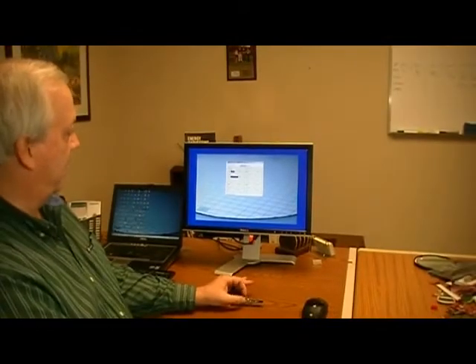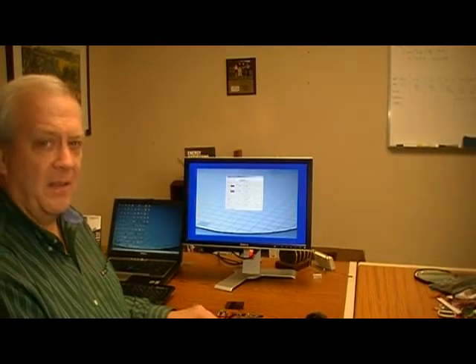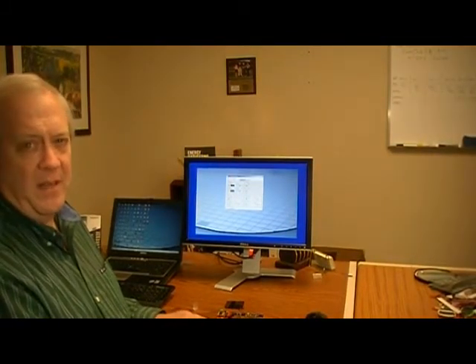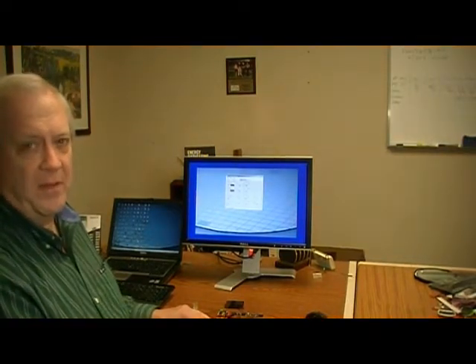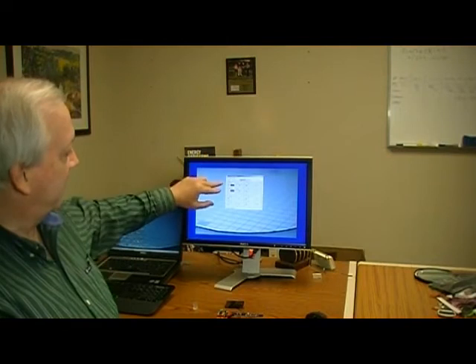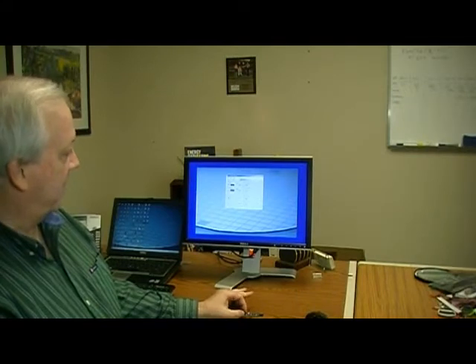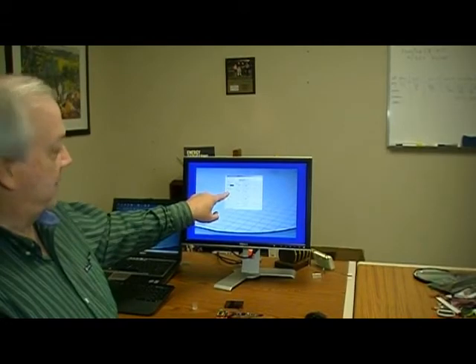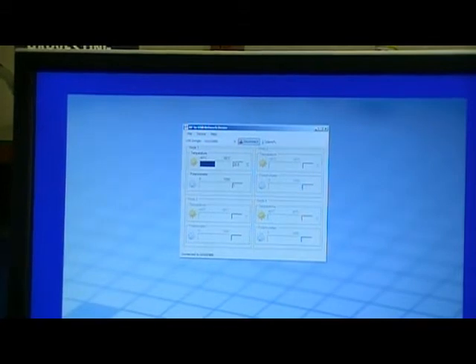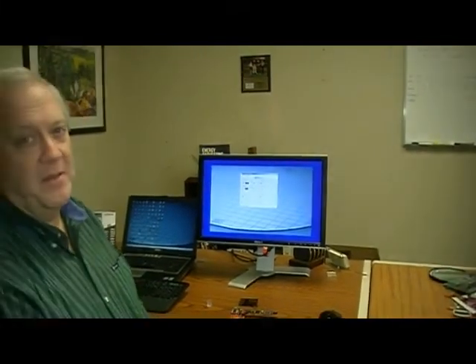Currently this is programmed to update every 10 seconds. With low energy harvesting, typical RF links have a low bandwidth, so we've set it up to be 10 seconds. You can see now that the potentiometer has come down to about half of the value it was at. I'll set it back farther down — we'll wait a few more seconds until we see the light blink to say the potentiometer goes back down to zero. That's basically how the demo runs. You can imagine any payload could be sent rather than the potentiometer voltage, but that's what this particular demonstration does.